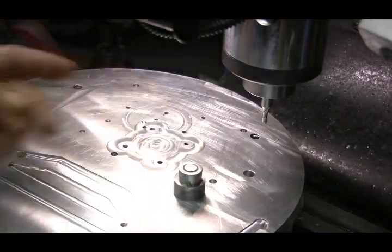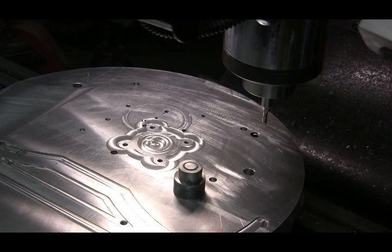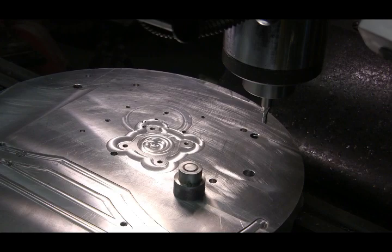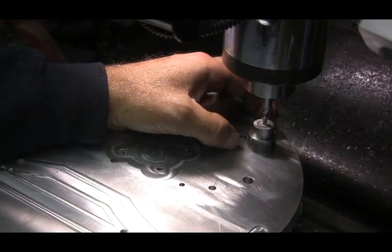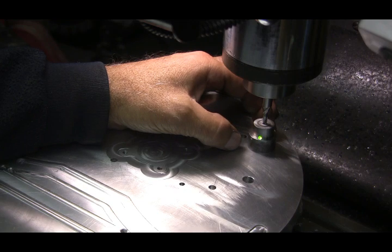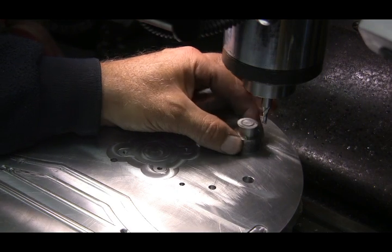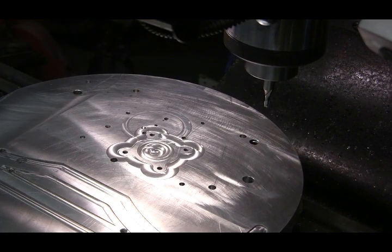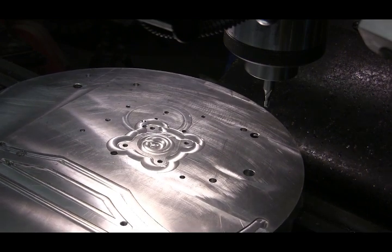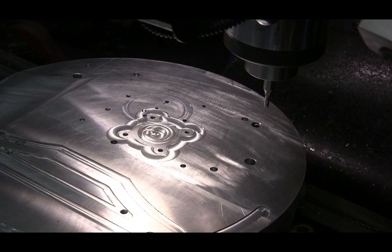I need to go up another half inch, so that's 250. We're at zero — I'm going to start over here and touch off. It repeats right on. I need to crank it up 750 from there. I'm going to move my Z up — 750 — one, two, three, four, five, six, seven — seven hundred fifty — and I'm going to go an extra five, so it should cut five thou into the material into the base holding plate.